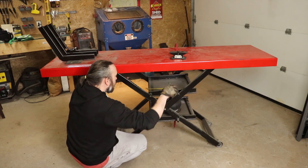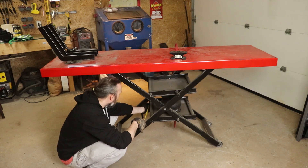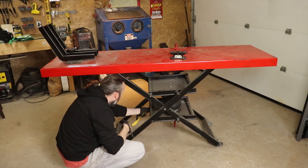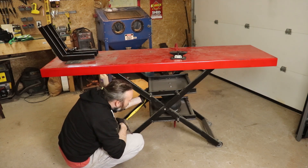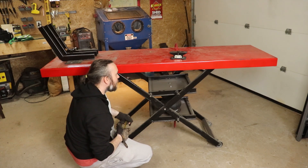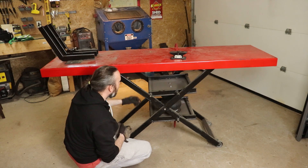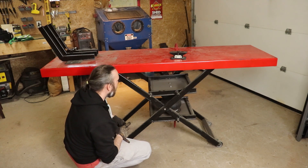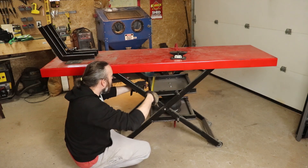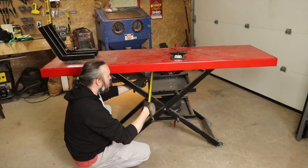Then you've got these two plates, and those are 18 inches by 18 inches. I've got those made of — I think it's quarter inch — actually three-sixteenths inch plate. Where the pivot points go through on these, I use a schedule 40 pipe that has at least 3/4 inch inside diameter so your bar stock will go through it, and that's all 18 inches as well.